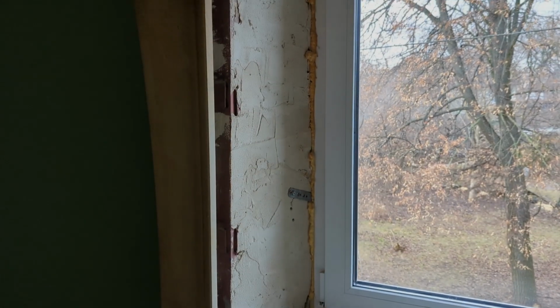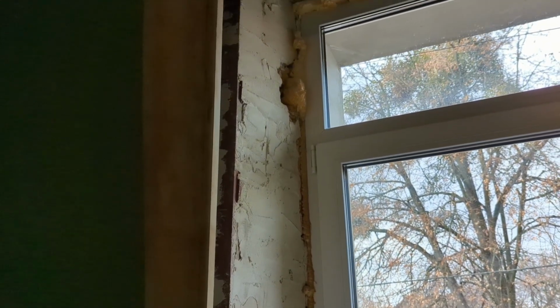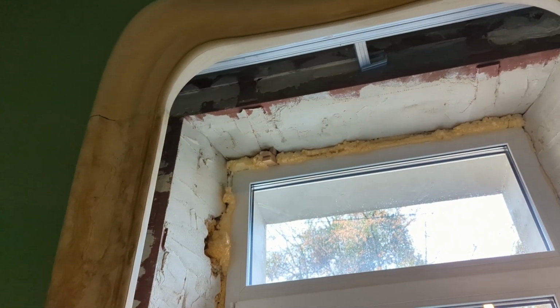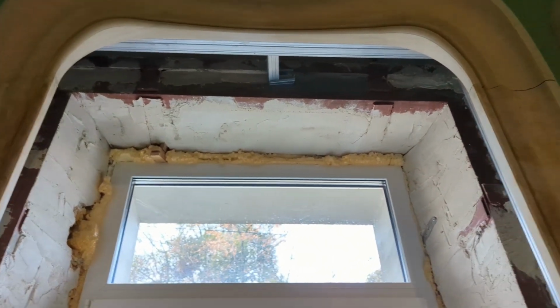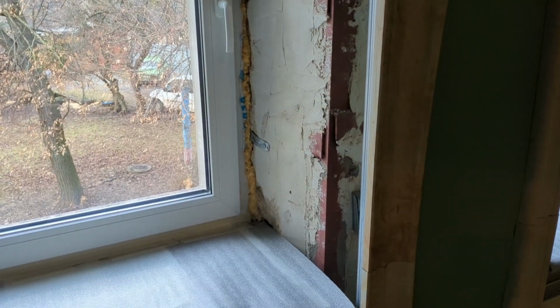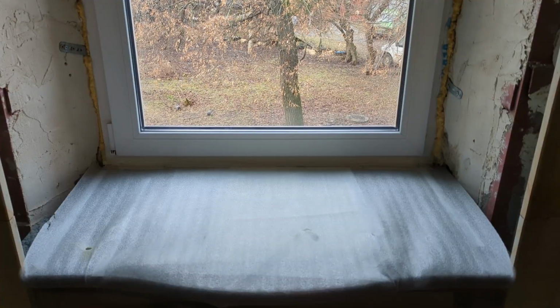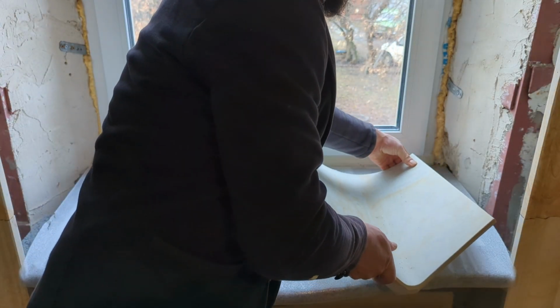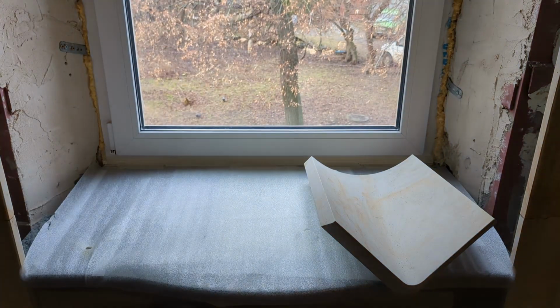This is what I managed to install in the last video. This house is very old and has undergone renovation. This metal around the windows is part of a reinforcement system designed to keep the house from falling apart, which complicates my installation. Now my task is to make sure that my stone structure won't depend on its attachment to the walls when it's assembled, and it won't collapse if the connection between stone structure and the walls fail. So I'll start with these corner pieces.